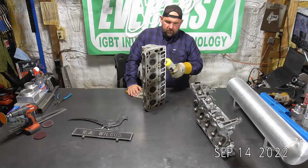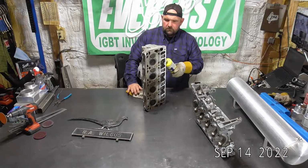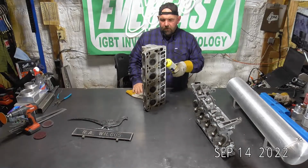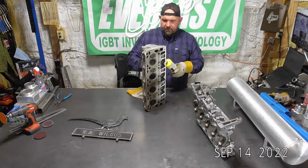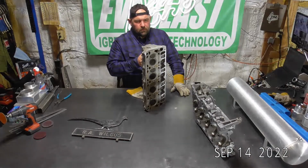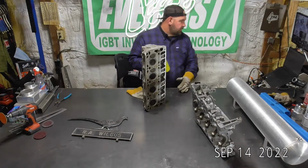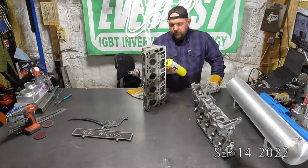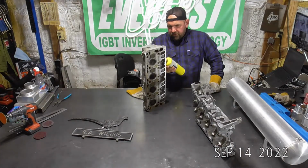So once I stop seeing the moisture, it's already pretty warm. I bet it's 150, 200 degrees already. It's pretty hot. But no, on thick pieces, if you're underpowered, like if I was running the 210 EXT, it would be nice to throw a preheat on this for the 210. The 325 though, I'd have no problem running this cold.